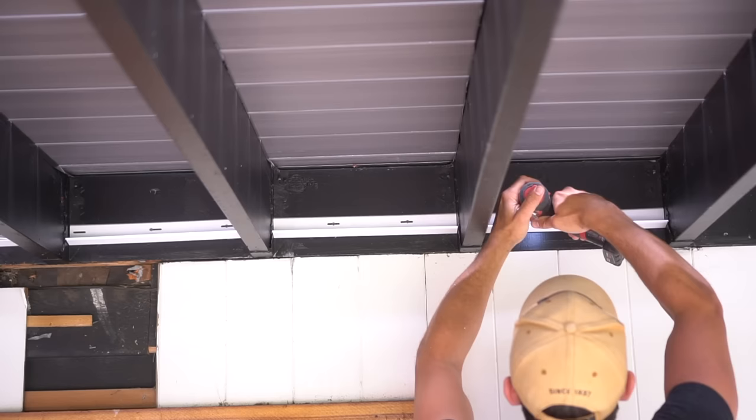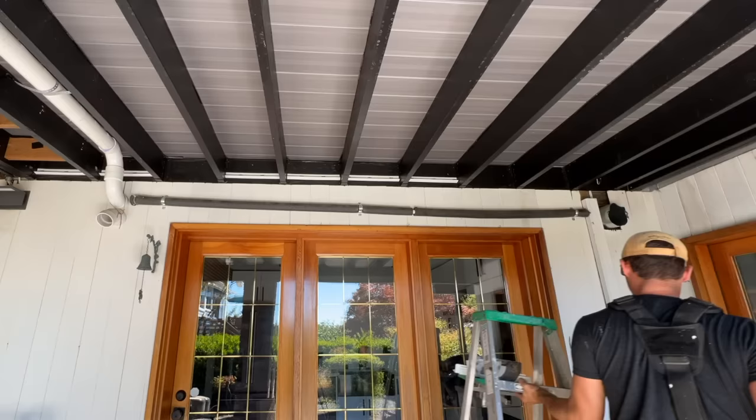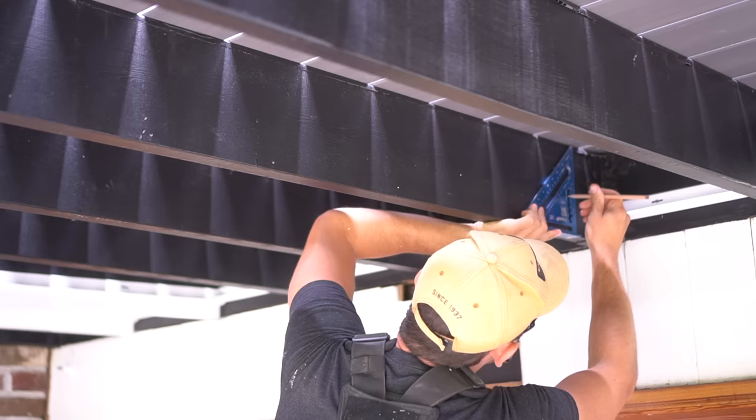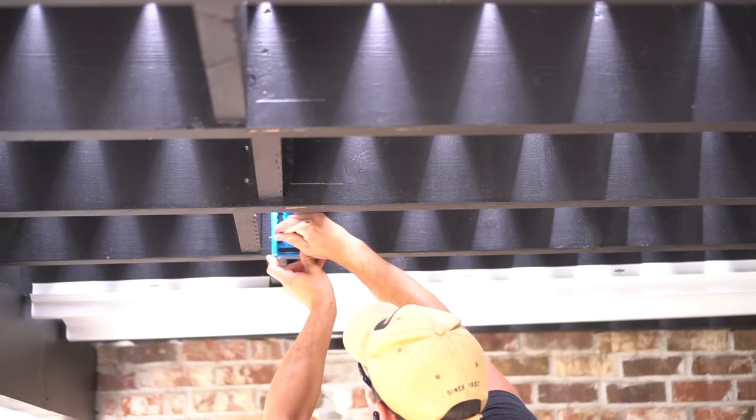I do burn about a quarter inch from the measurement I took previously so these brackets fit in easily, and it also makes room for the secondary combo bracket that we'll install next, which slides right onto the side of each bracket — which is why we need a little extra room. Now that all the F brackets are installed, we can move on to the combo bracket. The truly important part about the combo bracket is to make sure you have the proper downward angle at every single joist location, because we want to guarantee that water flows naturally with no standing water at any point.